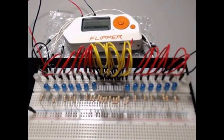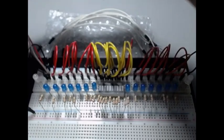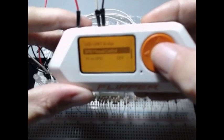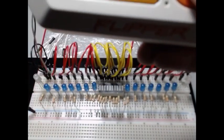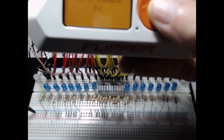Now I'm going to take a white wire and go from left to right. I'll go into the red pin — GPIO C3 on the Flipper Zero. Going up like this, push the center button, and go all the way to C3. See how it lights up red? Even though the camera looks a little different, that little RGB LED is lighting up red.